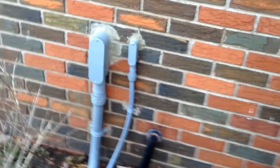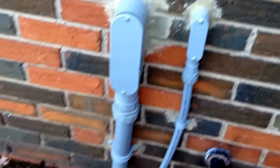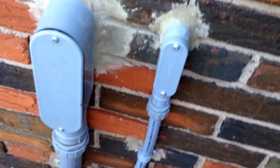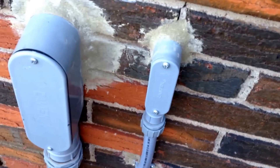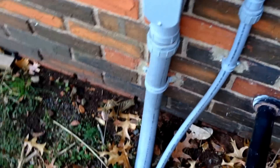This is where the wiring comes into the generator and goes back to the transfer switch, comes in through the house. Coming out of the house, this is the other side of that — here is where the power lines apparently go into the house. The control wires come into the generator; they go from the generator into the house, telling the transfer switch to switch over, and probably the sensor wires which tell the generator there's no power on the main lines. This is really a professional job — nice job.